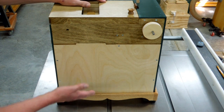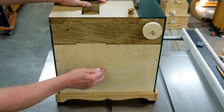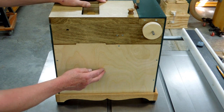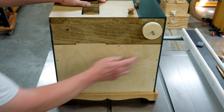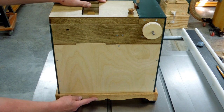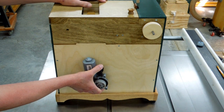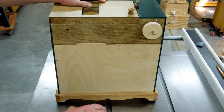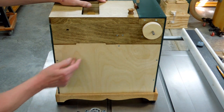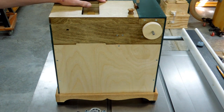This piece of plywood I've nested in here and made very solid. This is a piece of quarter inch plywood and I've put supports here and here across the top, and it wedges into a groove down here as part of this base. To make this quite solid to be a motor mount, ordinarily this is just a little piece of eighth inch plywood that just covers this up. It's got some sound holes cut in it and it just covers the back of the organ for show. In this case, this is going to be structural.